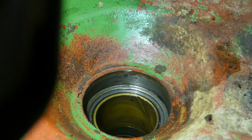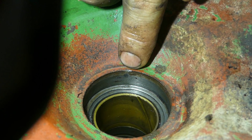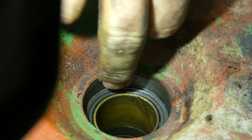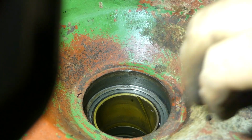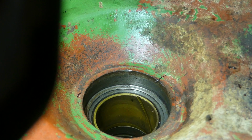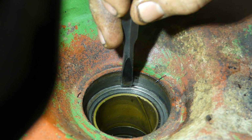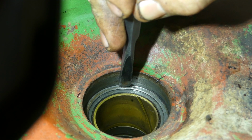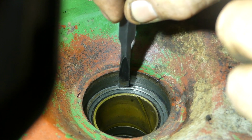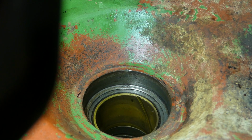I don't know how many of you use a Cape chisel or a straight chisel to do that, or a round chisel, but you can see there's, I wish you could actually feel that. There's nothing there. It's actually a perfect little piece, and you can see how the divot, when I pounded straight down, I did get into this just a touch. Probably went a little too far, one hit too many, right? Every time. But that's where it went down, and that's a nice smooth finish. So that's it for the Cape chisel.